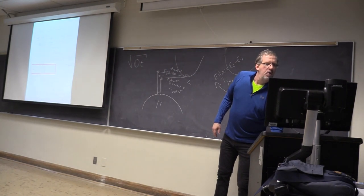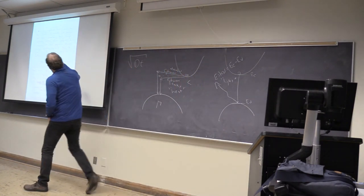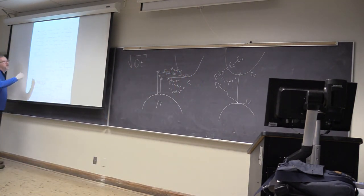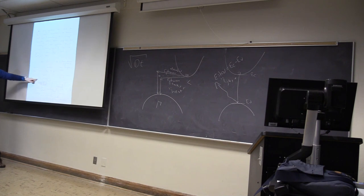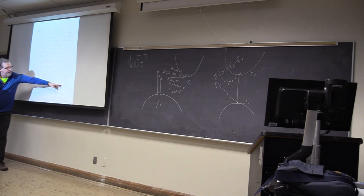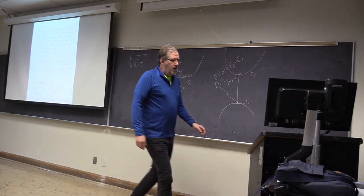So if you follow that, then you go through, and if N sub D, the donor density in this particular example, is 10 to the 17, you assume full ionization. E sub I is usually E sub G over 2, but the homework problem you haven't even started, you're going to have to find out where the deviation is from that by going back to first principles. And you find out from this that it ends up being right there, the Fermi level. That's the watermark level that tells you how electron rich it is.